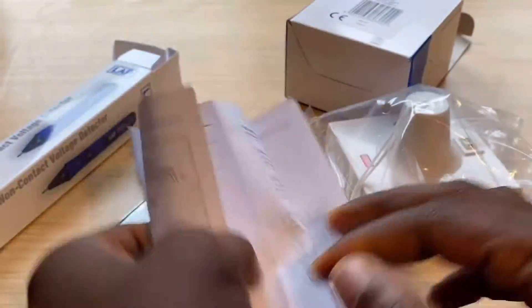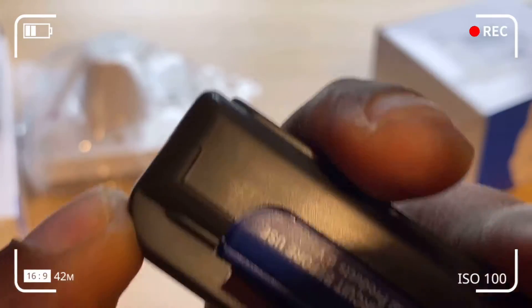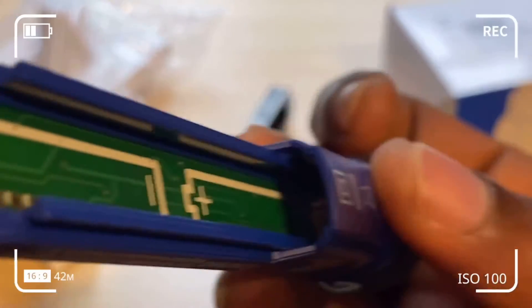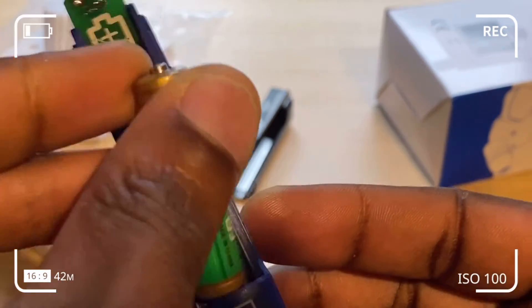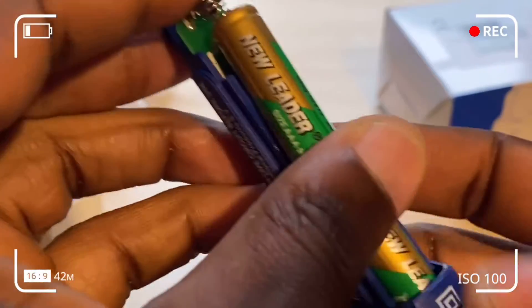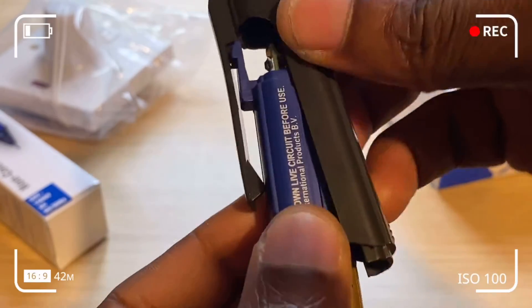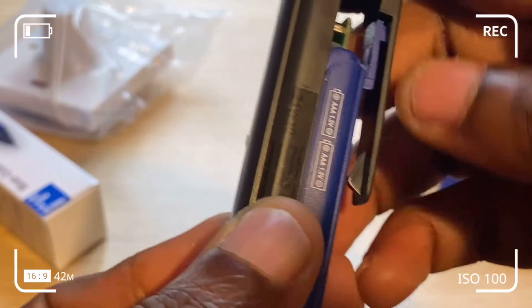The mechanism stopped working. The pen and the ceiling switch come complete with accessories. What we need to do now is install the batteries. We open the battery cover by simultaneously pressing the top of the pocket clip and sliding the battery cover out. We slide the two batteries in with the same orientation, lined up in the compartment of the pen, matching the negative and positive polarities to the terminals. When fitting the pen cover, ensure it's properly aligned — otherwise you could snap the cover. Pull the clip up a little bit and slide it in.